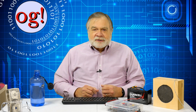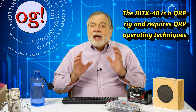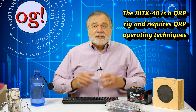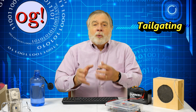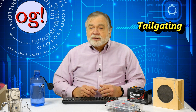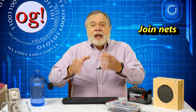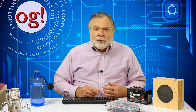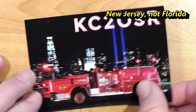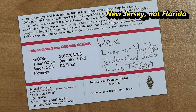I've had several QSOs. This is a QRP rig, and QRP operating techniques are essential to having any QSOs at all. No one has yet answered any of my CQs. The best method to have a contact seems to be tailgating — when you hear a strong station talking to another, you wait until they're done, then call the strongest of the two. Another method that works is to join a net when they finish their normal roll call and ask for any other check-ins. I joined a net oriented at those wanting to work for their Worked All States Award, and indeed there was someone in Florida who wanted Colorado. I got a two-by-two report from him, but we did complete the late afternoon QSO on 40 meters after several attempts.